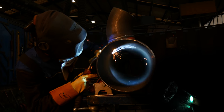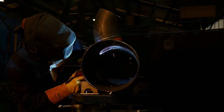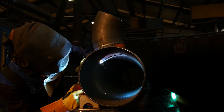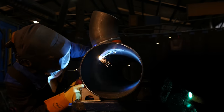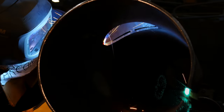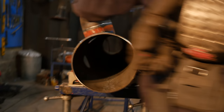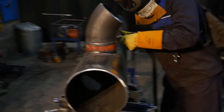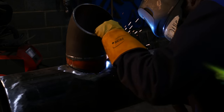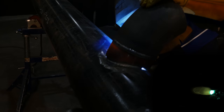If the welds get too hot, I lean the pipe down so it doesn't blow through, or I turn the amps down as well. I'm adding a little bit of a weave into it as well. What tends to happen is the prep side doesn't have enough metal to hold all the heat, so that side blows away or burns away too fast. This side has such a tight gap, so I'm going to turn up the amps, and I'm not going to stove this one too much, not unless I have to.